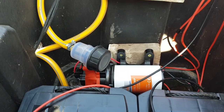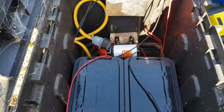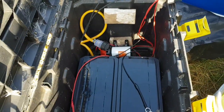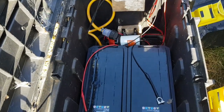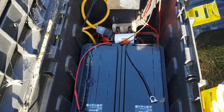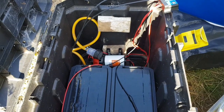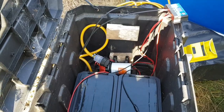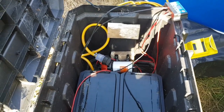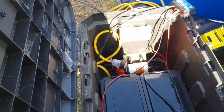A similar setup is perfect for any application where you need to pump water around — whether outside or inside, inside a cabin, on a field, a proper house, even a camper van. You just need a water tank. I'm using a big rainwater tank, sucking it out and pumping through at 60 psi, which is above most houses — my house is only about 35 psi. There's 60 psi going a hundred meters uphill, no problem, squirting out.